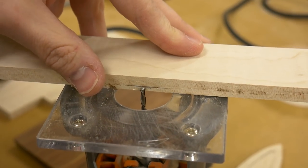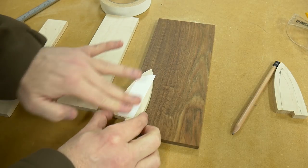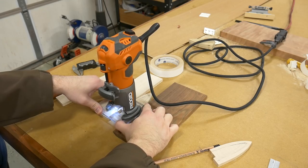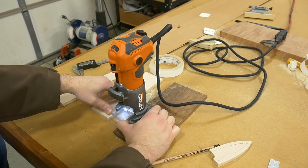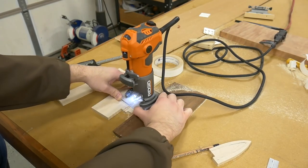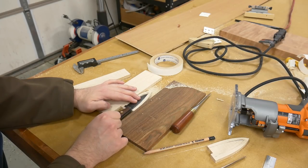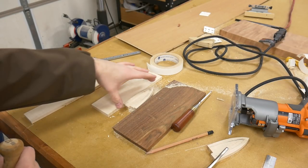To remove the waste, I'm using an eighth-of-an-inch spiral bit in my trim router. I put some tape on the sheath, stick it to my assembly table, and I have two scrap pieces of wood that are the same exact thickness as the sheath, and then I slowly remove the waste with the trim router, making sure to stay inside of the line. The two scrap pieces taped down to my assembly table help support the router because this is a really tiny piece and you can't rout it away without some support. The router bit left pretty ragged edges and I couldn't get all the way up to the top, so I used my eighth-inch chisel to clean that up. Before removing the piece, I made sure the blade fit and it was nice and snug.